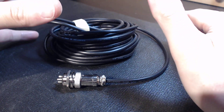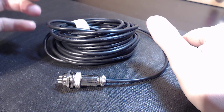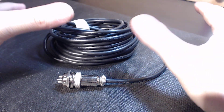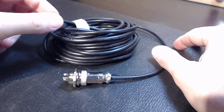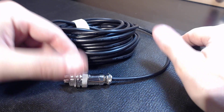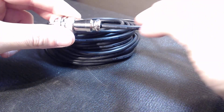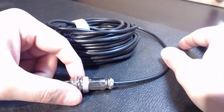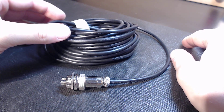Two-lead cable is typically what's required for accessories, but if you feel you need more than that, message me and I'll give you the best price I can. Keep in mind any custom ordering will have custom fees attached — there's nothing I can do about that overhead. This setup will cover about 95% of all machines. For multi-cable type machines, there's always 18-4 standard shielded cable as an alternative, but under general practice the 18-4 is much thicker, less flexible, not double shielded, and doesn't come with the connector already attached. Overall, I wanted to offer a plug-and-play setup and I think we've done that. Get in touch with me and we'll see what we can do — thank you, take care.